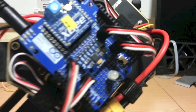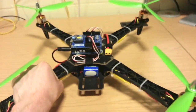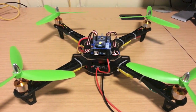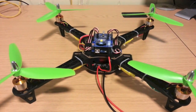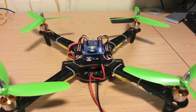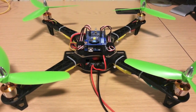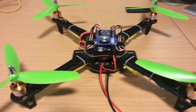With mine I've attached the four connectors to my ESCs, an RGB LED, and in the centre is my new IMU chip. So instead of using two separate chips — one gyro, one accelerometer — I purchased an MPU6050, a six degrees of freedom IMU. It also comes with a built-in temperature sensor and a power indicator. I'm very happy with the chip: nice and neat, very small footprint, incredibly light, one-chip solution. Even better, on the Arduino website there are libraries for this chip — Kalman filters with IMU libraries — and within five minutes you can detect change of movement, pitch, roll and yaw. It's brilliant.